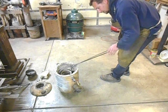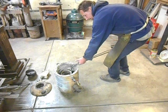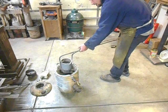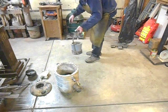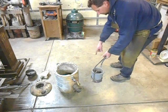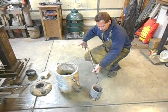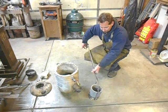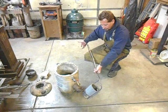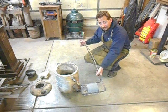Get a good hold of it, decide where it is that you're going to go with it, and pick it up. Let's say we've got a flask over here somewhere and we're going to pour it. Take your T-handle — and I usually like to brace my arm up on my knee — and then just rotate it up, pour your charge. See that right there?